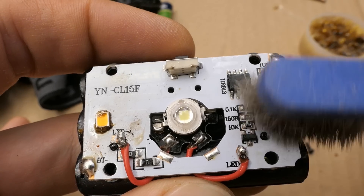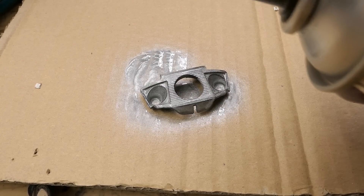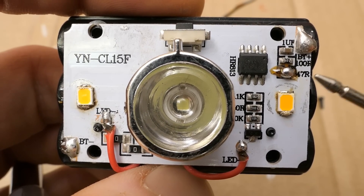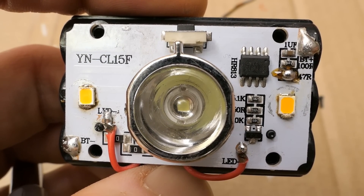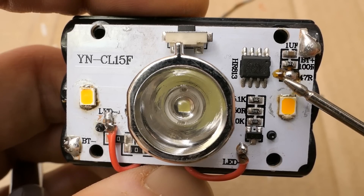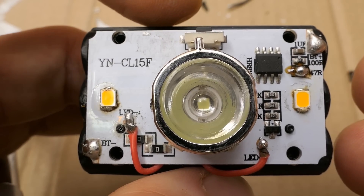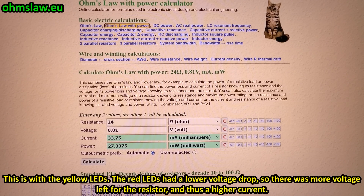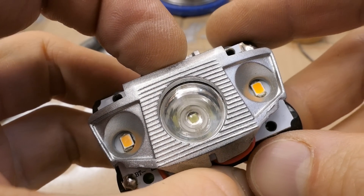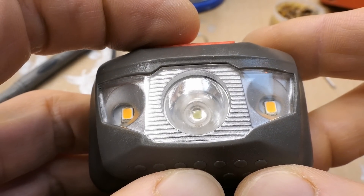Cleaning the flux residue off using ethanol. This reflector surface should actually be silver, shouldn't it? After applying a couple more layers of silver paint, I considered what resistor to use instead of the 24 ohm one. It turns out the internal resistance of the chip's switching transistor is so high that even shorting the resistor keeps the current low — about 80 milliamps, or about 100 milliamps total for both LEDs with full batteries. Based on my calculation, the current before bypassing the 24 ohm resistor was about 33 milliamps, since the voltage drop across it was 0.81 volts. The reflectors look much better silver — like they were supposed to be that way.